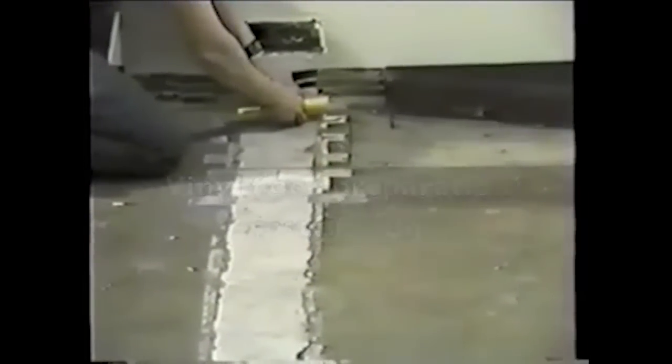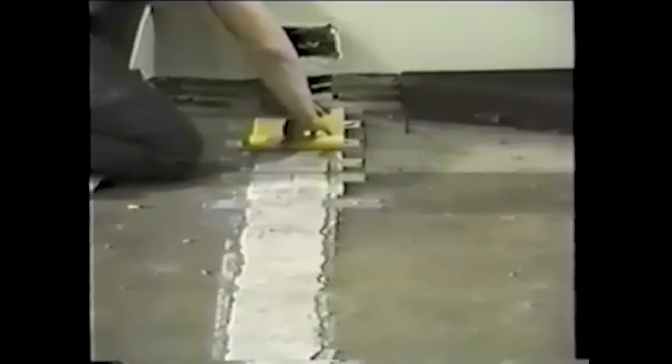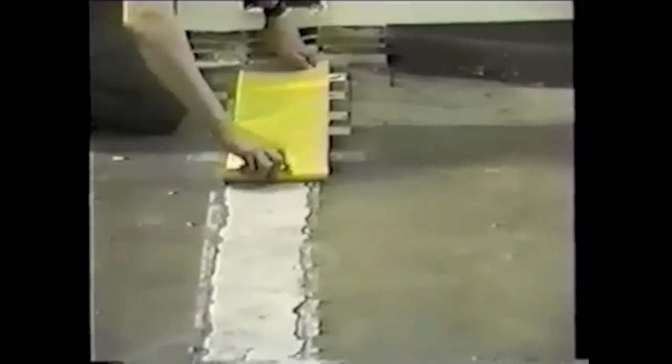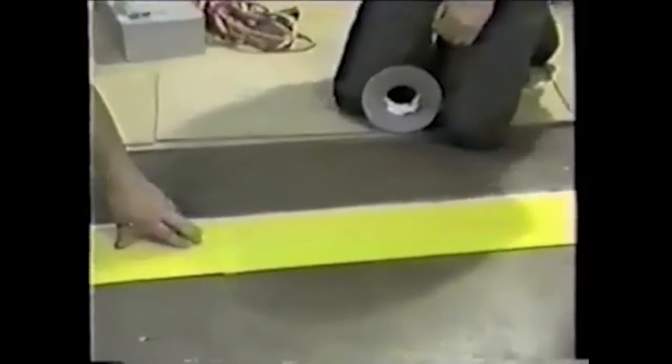Yellow vinyl floor preparation is required for all slab-on-grade and below-grade installations of undercarpet power cable and is optional but recommended for all other installations. When installing the vinyl floor preparation, all joined sections must overlap a minimum of 1/2 inch and be taped to the floor along both edges of the overlap with a short section of hold-down tape.